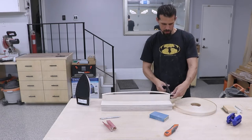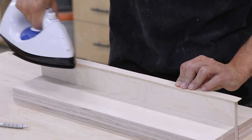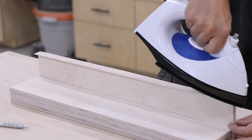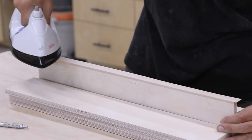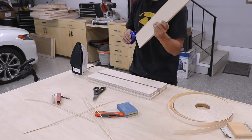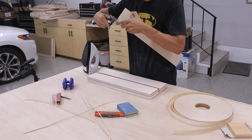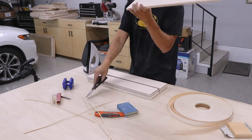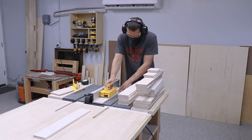After we get all the pieces cut out, we put on the edge banding. We cut it to size, get the iron nice and hot, and start applying it - you'll feel it kind of sink down when it's starting to adhere. I make sure to hit all those edges well so the adhesion is really tight and you don't see open gaps once you trim it down. Then you use an edge band trimming tool with razors in it and just run along the edge to cut off all the excess. I have links to the supplies I used down in the description below.